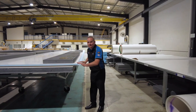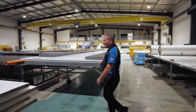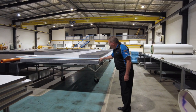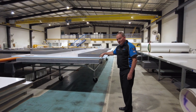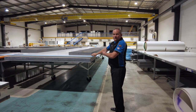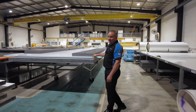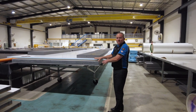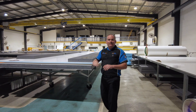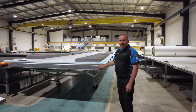Check this out — 10 meters long, 2.8 meters high, 2.5 meters wide when finished. It's a 16-pallet dry goods truck body — it's huge. We've got a 105 mil thick roof panel sitting on a 30 mil panel. It's 10 meters long, 2.8 wide, no steel frame — just composite panel, 30 mil thick, incredibly strong. Truck bodies have been built this way for years. If anyone says composite panel can't handle off-road in a caravan on bush tracks — here's something way bigger taking way more load.